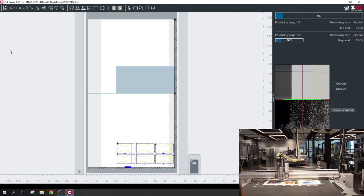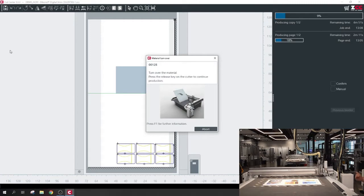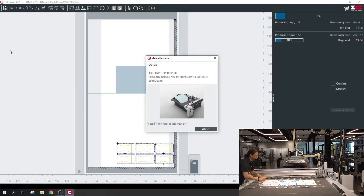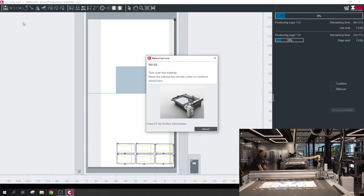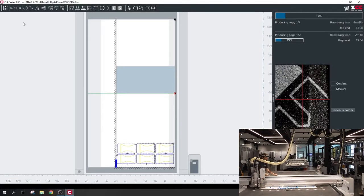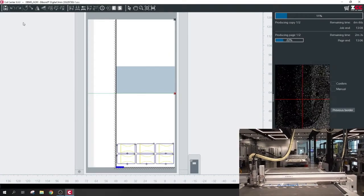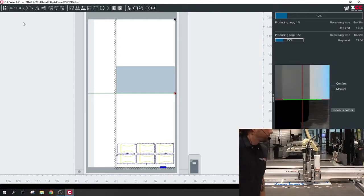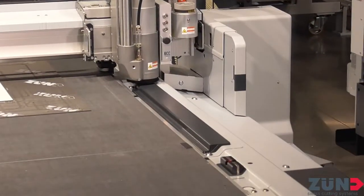Flip cut — we can do the bit replacement while we're working up front because we have tandem. It shows you exactly which way to flip the piece around — it's always on the Y-axis. The nice thing about flip cutting is only the first copy needs to be registered from the top side. Nate was able to flip that piece in the back over while we had the vacuum on in the front, re-registering that same edge but this time on the left side.